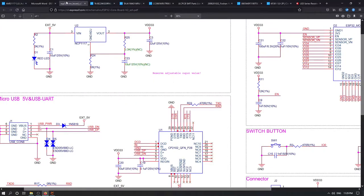Our schematic should look something like the datasheet example, but without the adjustment part. We need a 22 microfarad output capacitor and a 10 microfarad input capacitor. In addition, I would like to add an SMD LED diode on the 3.3V rail and one resistor to limit the current.